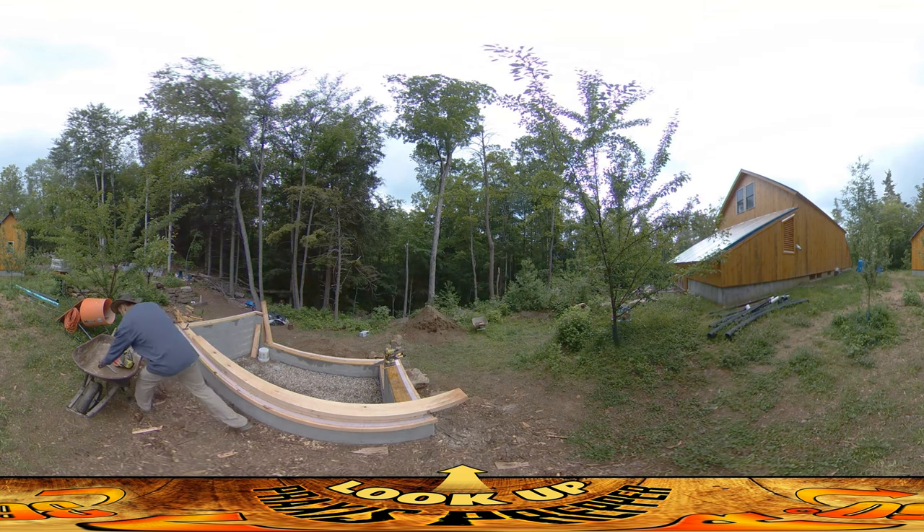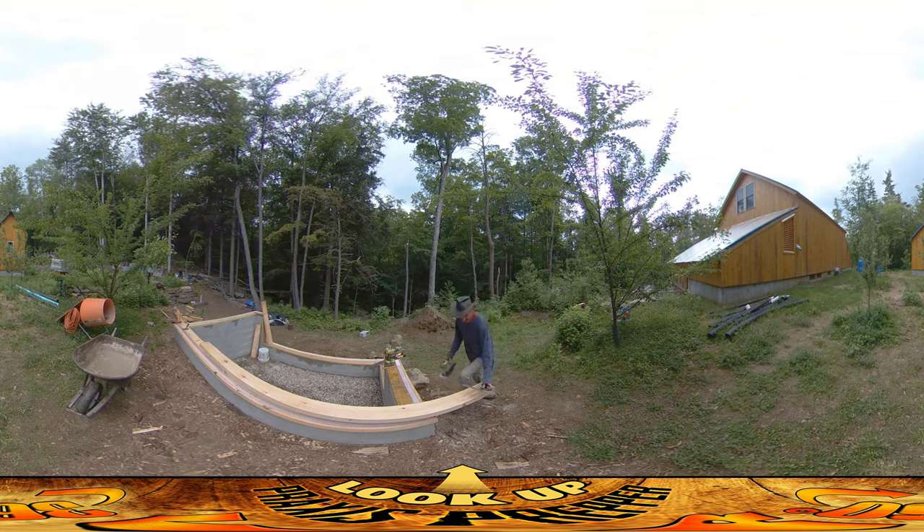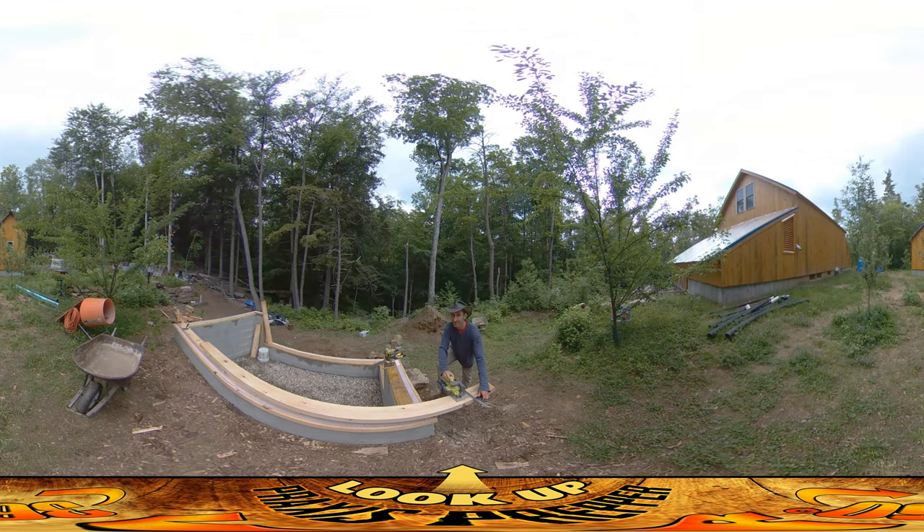I've got a couple of tools here — using this as a guide for getting a nice perpendicular cut to the edge. I'm going to show you what I've been dealing with. You can use a speed square or a carpenter's square, but what I do is tap it up to the side and then rotate it up just a little bit so the side goes on the edge, giving me a nice straight edge — I don't even have to draw a line. So I start cutting through, and already it sounds labored — it's not a low battery, it's that the wood swells with all that moisture and it squeezes the blade as it goes through. At some point it might start smoking, which is why I stopped.